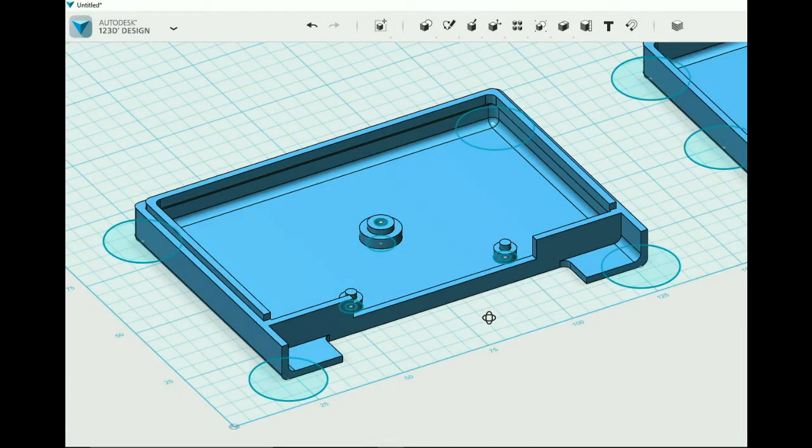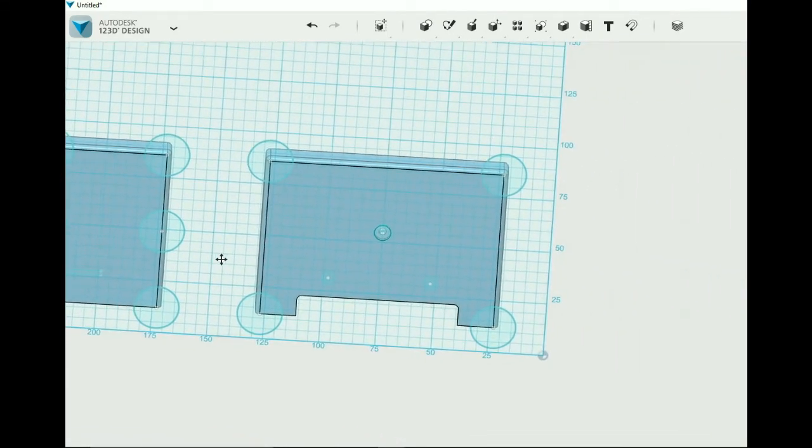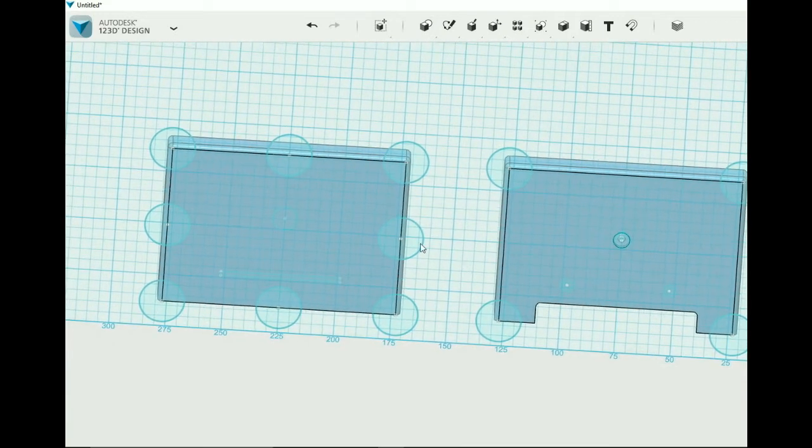As you can see, we got some circles out here on the very lowest part of the layer, and they're like that on both boards. And the reason for that is these are actually from mouse ears. Now, if you've never 3D printed, one of the disadvantages to printing with ABS is that it tends to warp, and it has to do with heat and cooling and everything else.